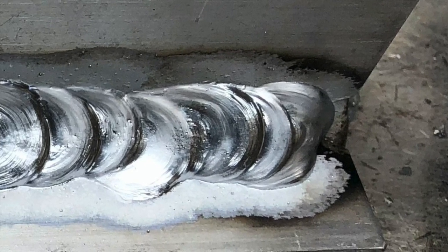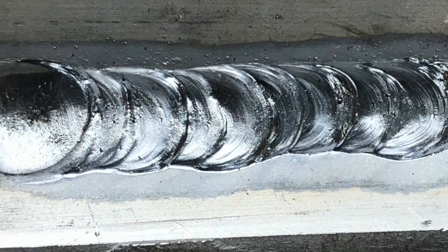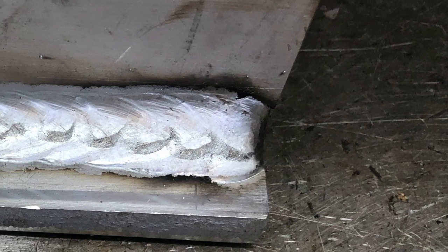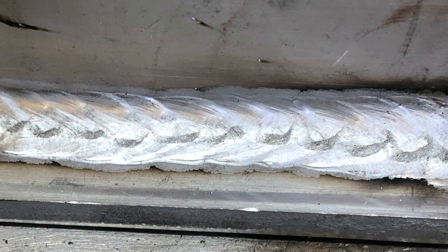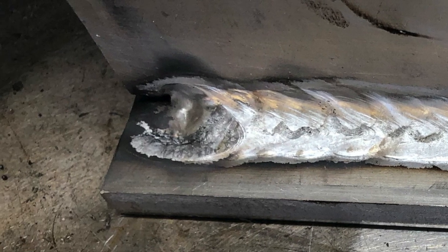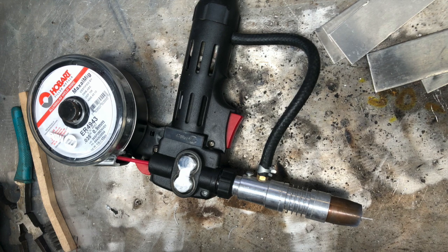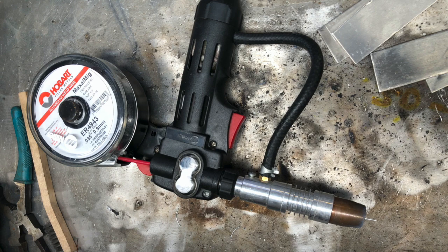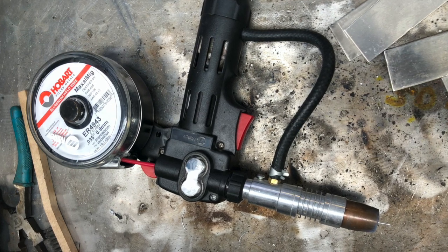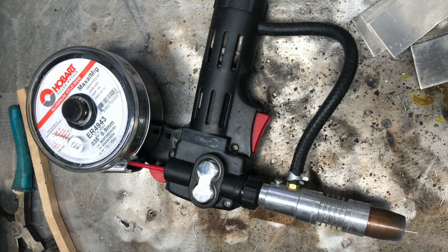Here I made some welds with a ten-thousand-dollar Miller machine with a push-pull gun, remote control functions, and a separate power source and feeder. This is a very coarse double-pulse weld, and this one is a double-pulse weld at the factory-preset speed — the other was manually tweaked a little. The welds look respectable; I didn't fully dial in the crater function but it works and welds really well. I also tried a spool gun off of a Miller 211, and it works the way it's supposed to. Part of the issue is they're using 4943 wire, which requires about an additional volt to a volt and a half on the synergic curve.